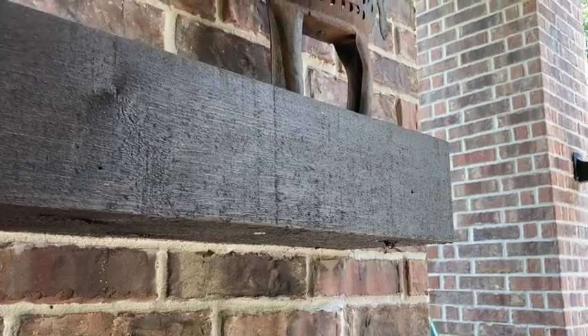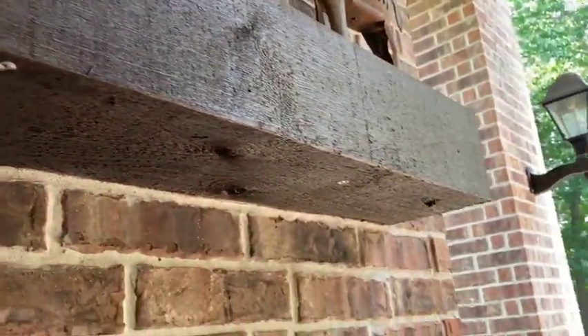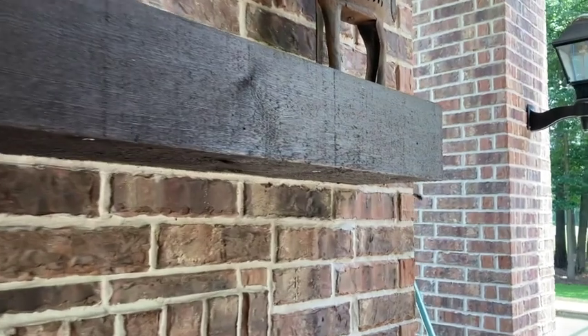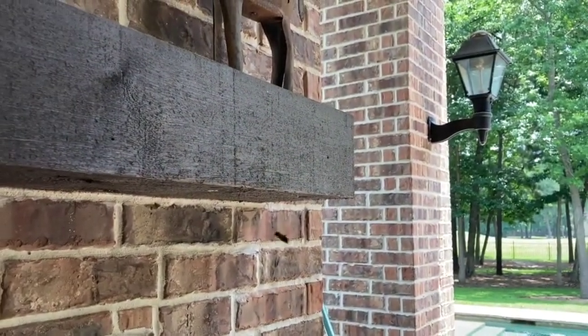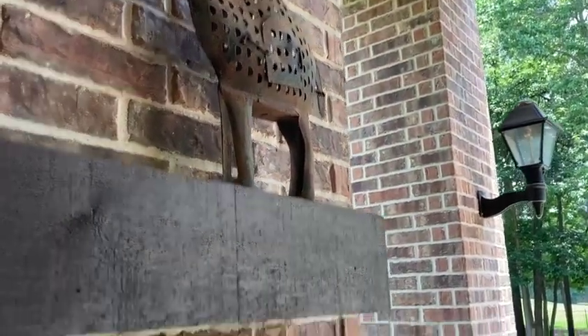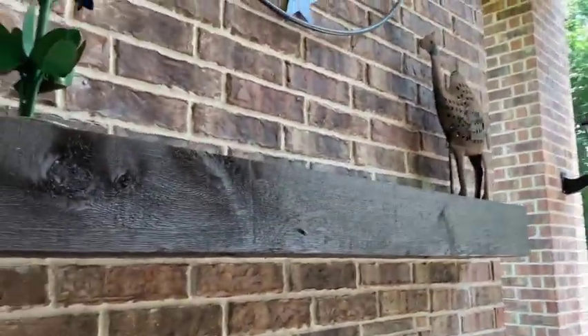I think we learned something going from the first to the fifth: go ahead and cut the flange off the wall anchor and recess it up inside the hole — it'll hold in there really well. Then we'll get some brown paint and paint over those, and I think we're done. I feel pretty good about how it turned out; I think those are going to be effective plugs with the plastic and the metal. Thank you for watching today's episode of Corporate Gone Country — I'm just an ex-corporate guy trying to do country things, and today I used some surplus stuff from around the house to deter these carpenter bees. Thanks for watching, please like and subscribe!